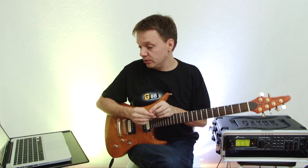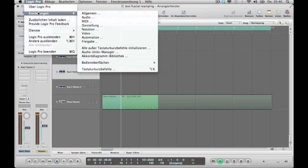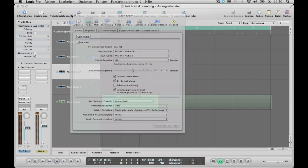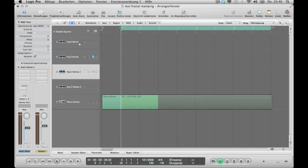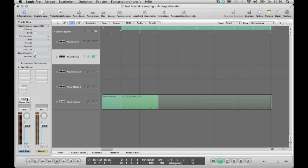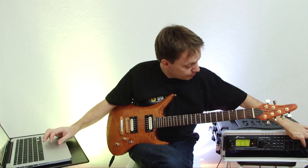When you open your recording program and make the settings, make sure you choose the XFX2 as both the output device and input device. You will have 4 input channels as I show you here: input 1 and 2, and input 3 and 4 for a stereo channel, or 1, 2, 3, 4 for mono channels. Over 1 and 2 is the normal stereo signal, and 3 and 4 is the direct signal which comes directly from the input.